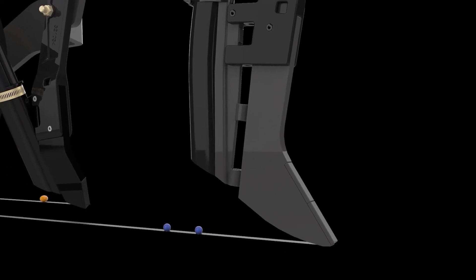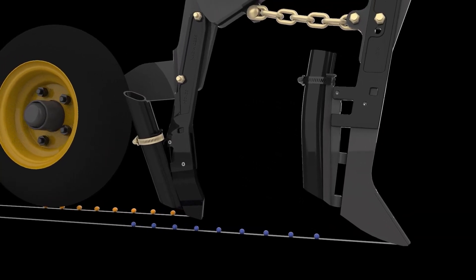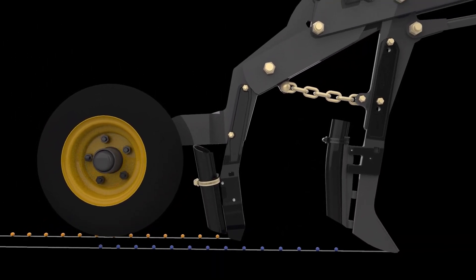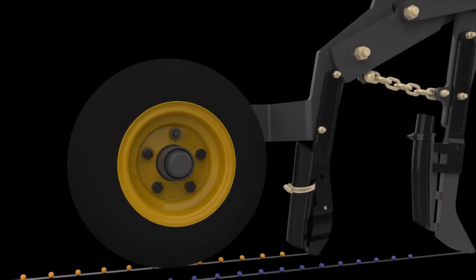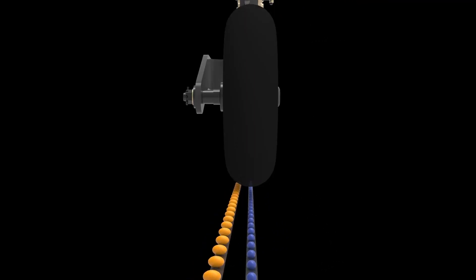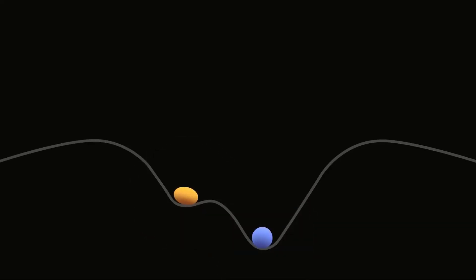The all-new inline sideband knives achieve sideband placement with an inline knife design. The seed knife cuts a separate shallow trench, where an angled seed tube places the seed 2 inches away from and ¾ of an inch above the fertilizer. The new inline design allows for better soil flow and residue performance, resulting in a smoother field finish. The new inline system also allows the grower to switch from sideband to twin-row placement if desired.